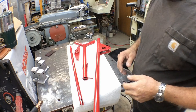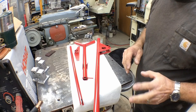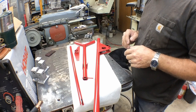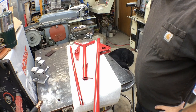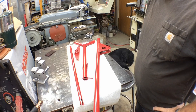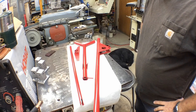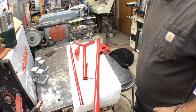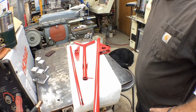Here are the last of my pieces out of the powder coat oven. They are ready to be reassembled in the plane and now I can probably start doing final hookups — nylock nuts on everything, proper length bolts, and all of that as we put them in. Before I reassemble these into the fuselage, I'm hoping to get at least a couple of warm days before winter really hits. I'd like to get some white enamel paint on the inside of the cabin just to give it a finished look. Then I can reinstall these, and when we go ahead and install carpet and whatever else we put in the cabin, that portion is done and I don't have to worry about disassembling everything.